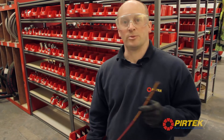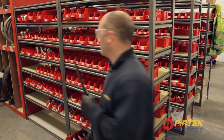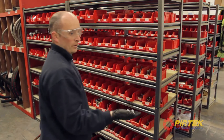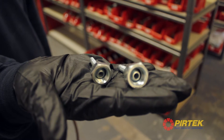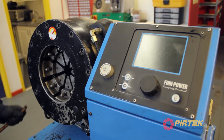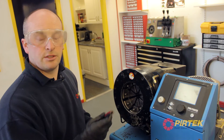I need to get two BSPNs for the hose, which are 80144s. That's our two 80144s for the other end of the hose. This is our swaging machine. I'm going to set the machine for the size of hose — it's 17mm.